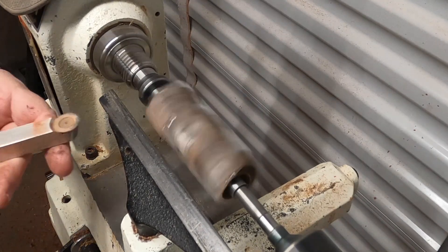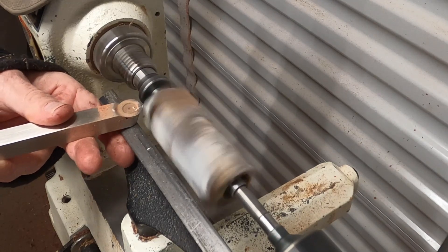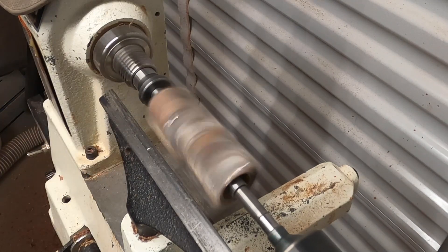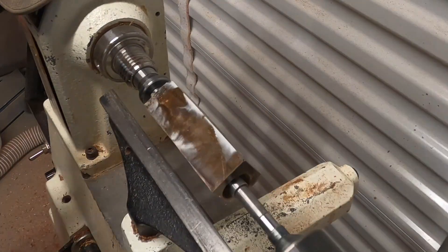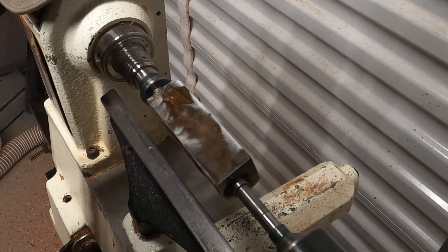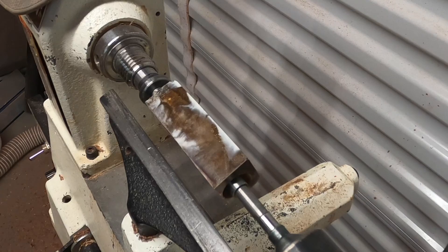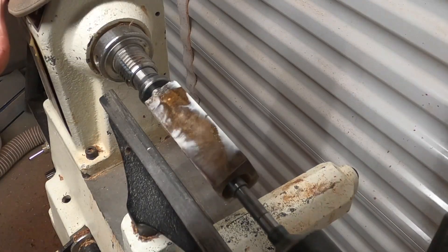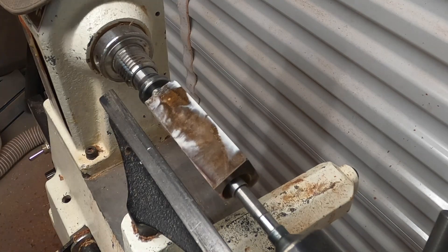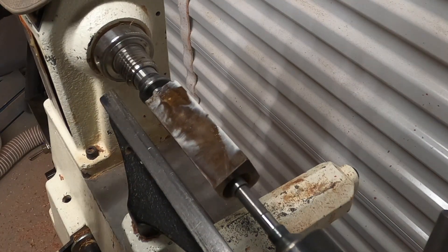There are two different places to tighten it down so it's nice and secure, because if I catch something — which is likely to happen when you're milling irregular things — that's a carbide bit by the way, see how it stopped? It caught something, so I realized I had to make this even more snug, or turn up the speed so it doesn't easily catch and stop the whole spinning process.